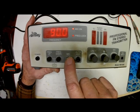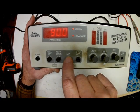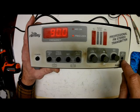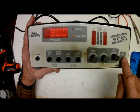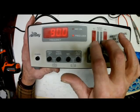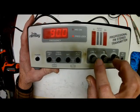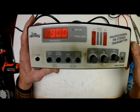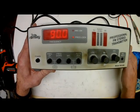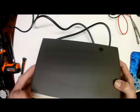These also have a mic input which ducks the audio when you're talking over whatever's coming into it. The mic is over here. This particular one — when I built it the mic connector was busted out of the package, but the guy doesn't use that so he doesn't care. It has two audio level meters and line inputs here for the two line inputs, and this is your mic level if you were going to use it. It also has an AGC — automatic gain control — for your audio.